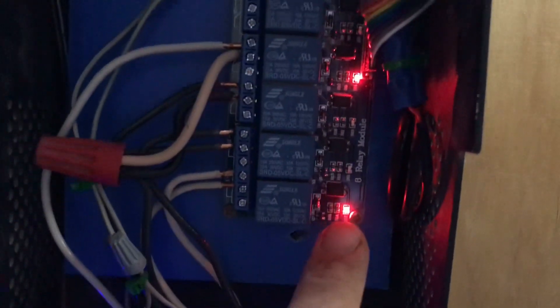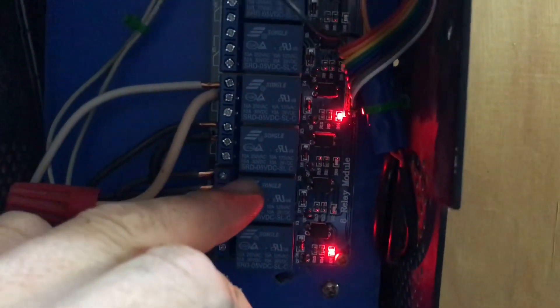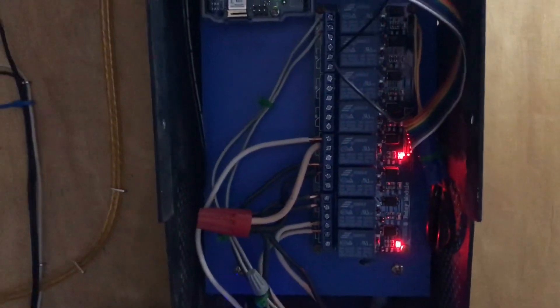These are eight electrical switches I can turn on and off via this microcontroller - the little rainbow cord tethers it to them. The ones down here are for the evaporative cooler fan and the pump. The red lights indicate the pump is on, and these are the three speeds for the fan. You write code and program it so there's a function to turn the fan on - it starts at high, goes down to medium, then low. Right now the temperature isn't that high so it's staying on low. If the temperature goes up it kicks up to fan speed two, then fan speed three. It's controlling the fan for us automatically because we're not out here all the time, and you want to get a head start on the heat.